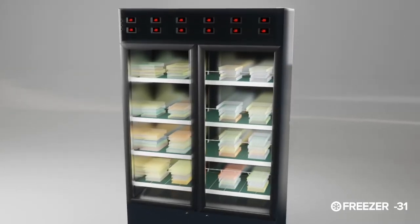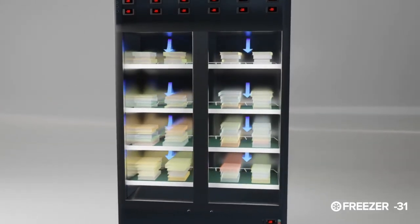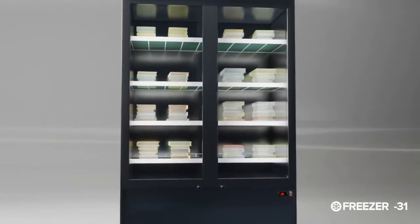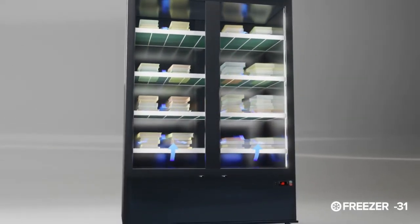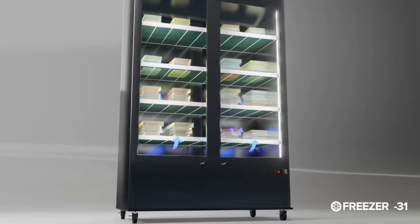Primary drying can be a slow process. Due to this, we programmed the heater alternatively to balance the temperature within the cabinet. The heating process will be about certain hours. This is in contrast to dehydration by most conventional methods that evaporate using heat.